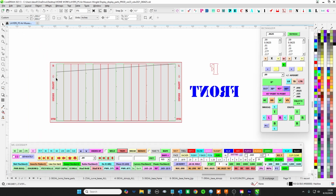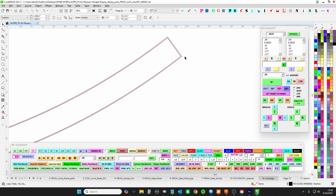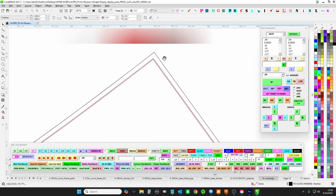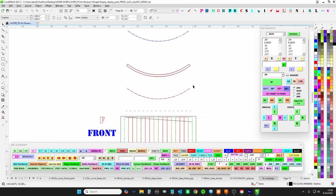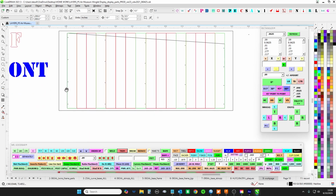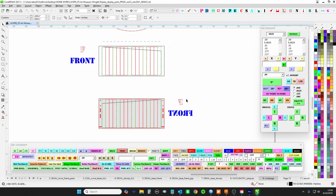Just make sure that you keep the trim router square, because when you're trim routing something that's a little bit over 90 here or whatever, you could dig in. So be careful that you keep the bearing as shallow as possible. And then when you're trim routing around, don't dig in, careful. But anyway, that's going to be the secret: circ saw off as much as you dare, as close as you dare, and then go ahead and do some trim routing. And that's how we're going to hit that target.